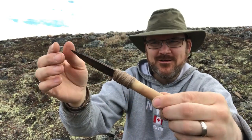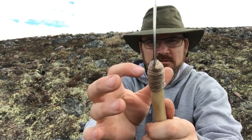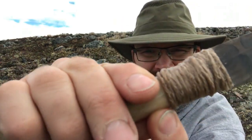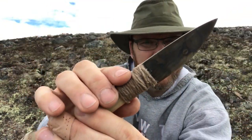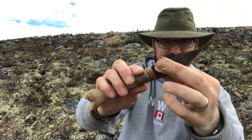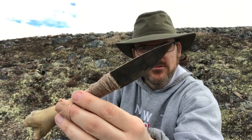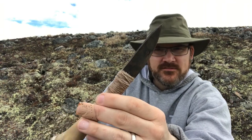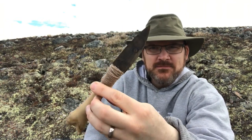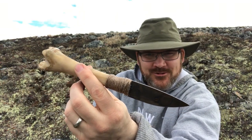I then painted clear epoxy over the jute twine wrap so it's hard and solid. The blade I left with the scale from the heat treat on it. It's professionally heat treated, hardened to 60 HRC, as are the other knives — all 1095. The only reason I did this knife is I'm just going to keep it — it's kind of an art knife or exhibit piece. I'm going to use it to decorate my office.